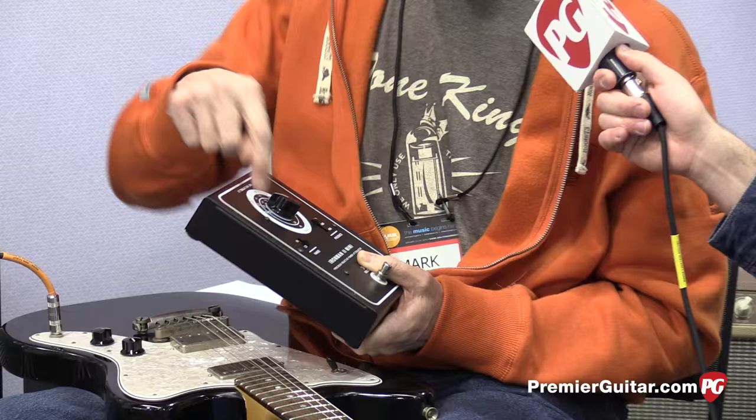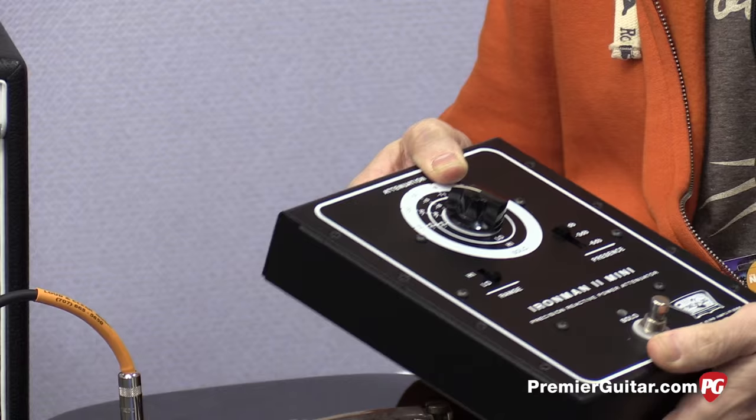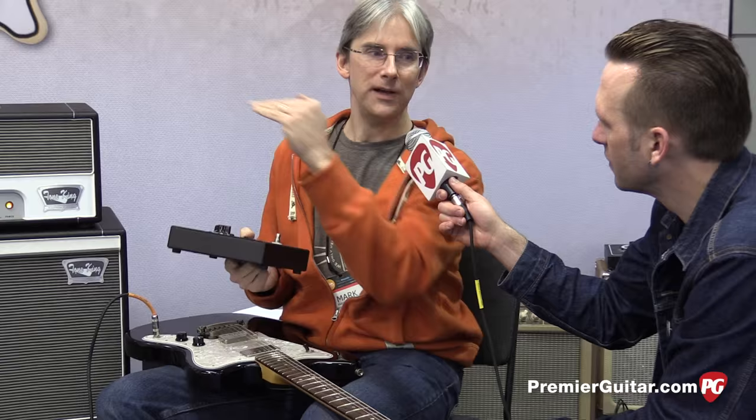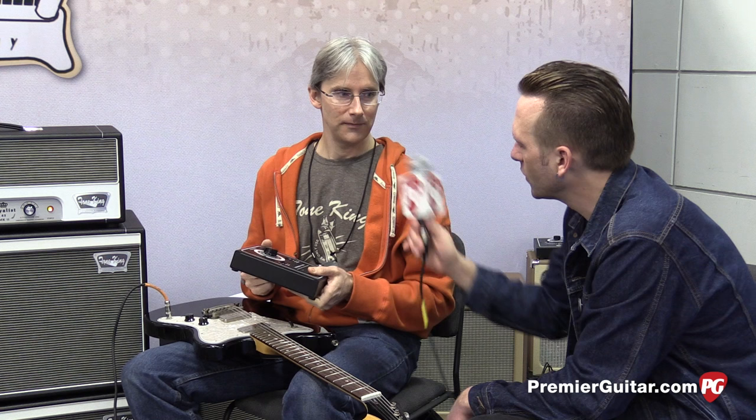To make it affordable, the standalone unit is limited to 30 watts maximum and 8 ohms only, so you can't use a big Marshall but it's great for something like an AC30 or smaller. It has 18 different attenuation levels. It can also be used in live performance — it has a solo button so that when placed on the floor like a pedal, hitting it gives a calibrated 3 dB or 6 dB reduction in attenuation to get you above the band. Third, it can be used as a standalone reactive load — plug your amp in without a speaker and go from line-out to DI or re-amp.